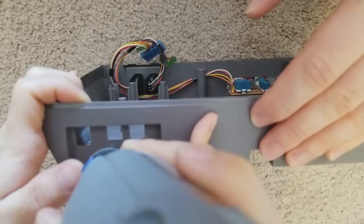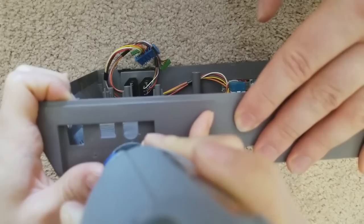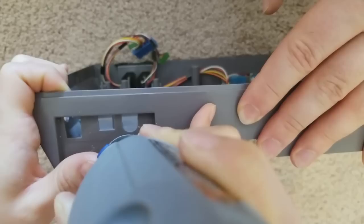Now it's time to cut the hole in the case for the multi-AV output. For clean results, I always like to use a Dremel tool. We've already traced out the shape that we'd like on the inside of the plastic. We start by drilling holes using the Dremel tool. Now we cut it out.